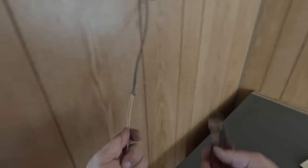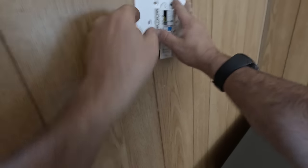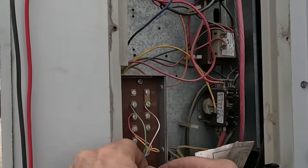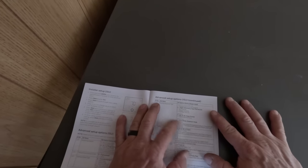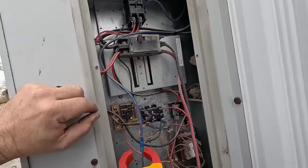Let's get in here and get some fresh wires. Strip that back - you really don't want to do that with your pliers if you don't have to because I've caused a short that way before. All nice and together - one wire up there. We'll raise it up a little higher to help keep that cold air draft from coming through the hole in the wall. We're going to go ahead and give them the parts we replaced and leave the product information here so they can program it. So we're going to program this thing as an electric furnace so it'll bring on that G terminal - electric air handler, number four.